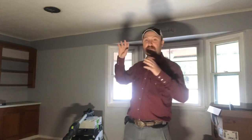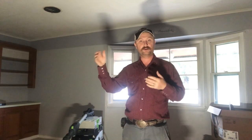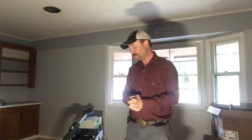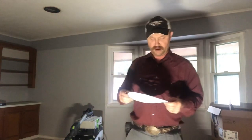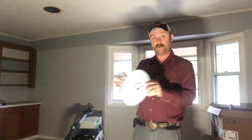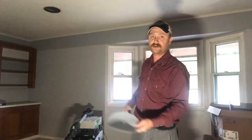On a ceiling like this — you can probably see it's already been sanded to the point they like it in this room. I'm going to show a couple clips of sanding the kitchen and this room. I'm running 40-grit Granat today for the first initial passes — 40 is really nice — then I switch to 80, then a 120. It's a really big sander: 225 millimeters, about eight and seven-eighths inches across.